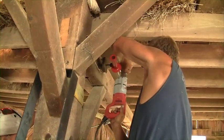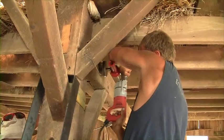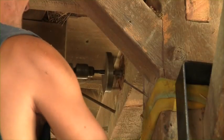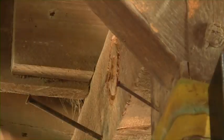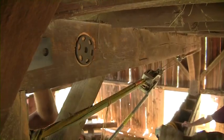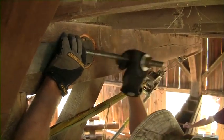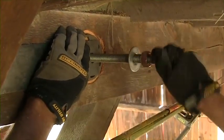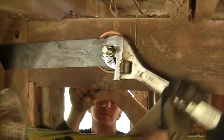The shearing cutter has a rod in the middle that follows the pilot hole, cutting a circular groove that conforms to the profile of the shear ring. You do that on both sides, chisel a little out of the middle, and the shear ring will sit flush. Install your shear ring, put your bracket over the top of it, run your all-thread through both sides with nut and washer. That joint is probably stronger than it ever has been or ever will be.